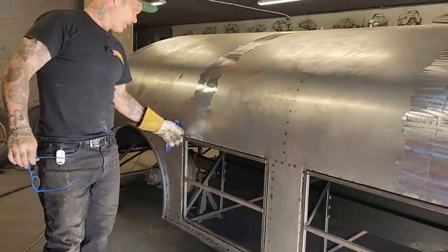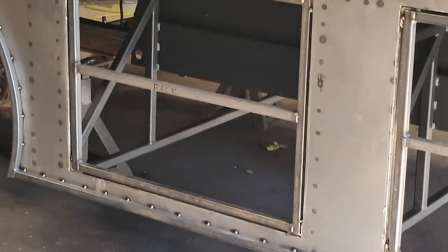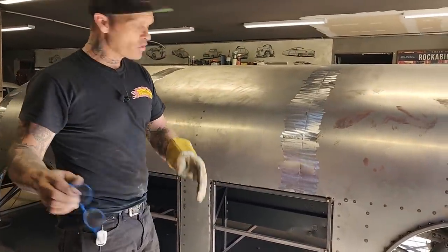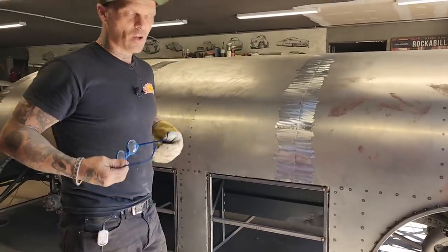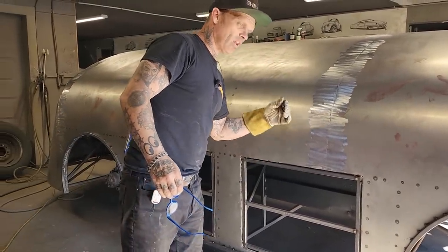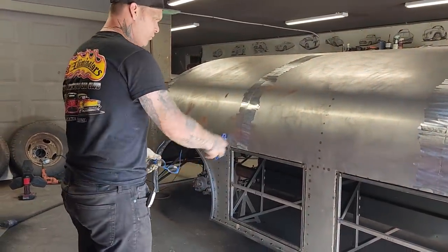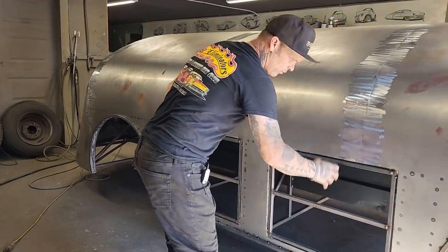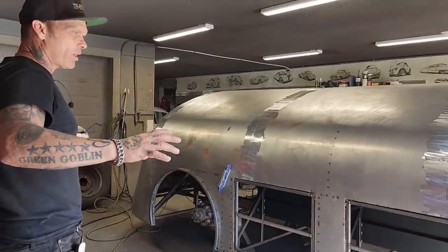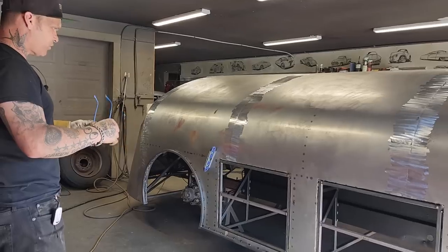Basically, I've done the exact same thing on this one. I put the angle iron in the corners. I'm thinking it's a 3/16. We made the two doors on the original I'm using for inspiration. What I want to do here is make one door, because it's less material, and why not? Why use four hinges on one door when I can use two? Why not use one piece of metal instead of two? Basically, I am making the work easier for myself, and if you can do that, I suggest you do it.